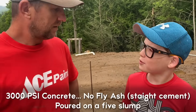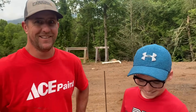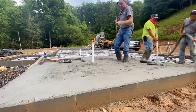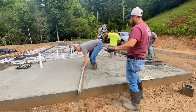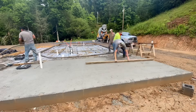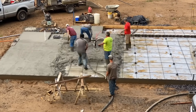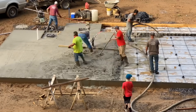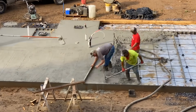Mr. Jason, what's your advice on pouring concrete? — 'I would say go to college.' To pour a concrete slab you have to break it into manageable sections. Our first section is about 10 feet wide; the usual range is 8 to 12 feet. This gives you a width that a straight screed board can actually reach across. Terry is hand screeding between two grade poles because of all the pipes. These poles are removed before the concrete dries and the indentions are filled in.